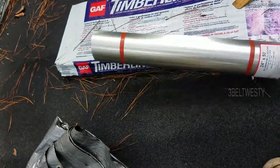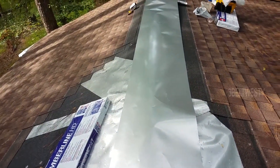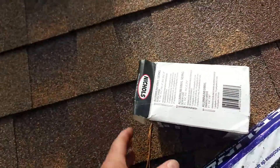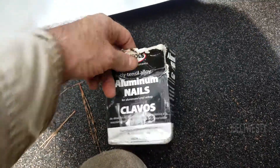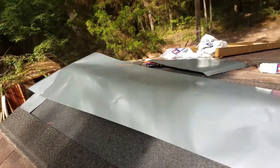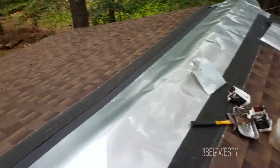The piece doesn't look pretty but it doesn't really matter. Putting this down with aluminum nails — aluminum nails made by Nichols in Alabama, actually made for vinyl siding. These are aluminum roofing nails by Nichols, high-tensile. You get less corrosion when you're going aluminum to aluminum. That's the ground piece to get bonded on there, nailed on with the aluminum Nichols siding nails, and that's going to connect up here.